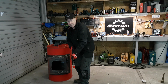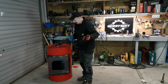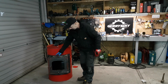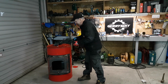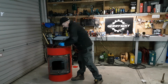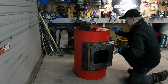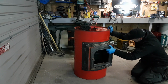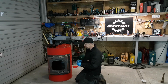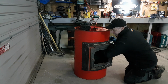These bolts are a bit long, and I want that so that I can leave them slack, go around it with the fiberglass rope, and then tighten them in, squashing the rope between my plate, you know, my monstrosity here, and the drum. So let's get a bolt in, because although it's a tight fit, it could easily fall out. Right, let's start one of the corners first. See if I'm lined up. Okay. Now, to save time, I've pre-drilled this. So I'm just literally going to hold this bolt and tighten it off the inside.